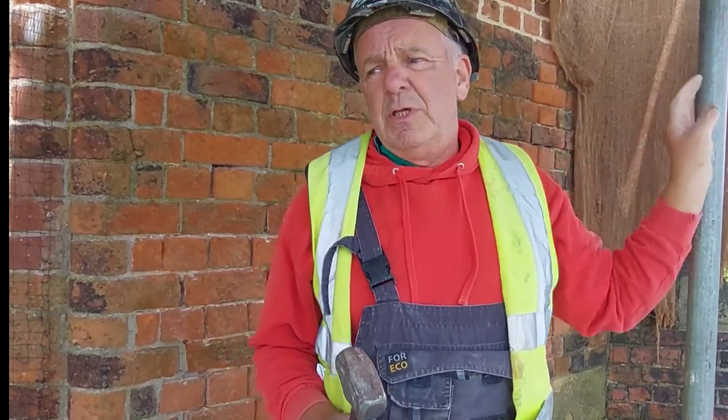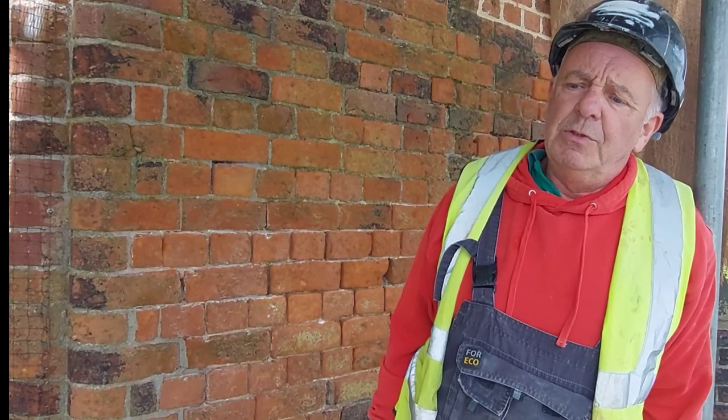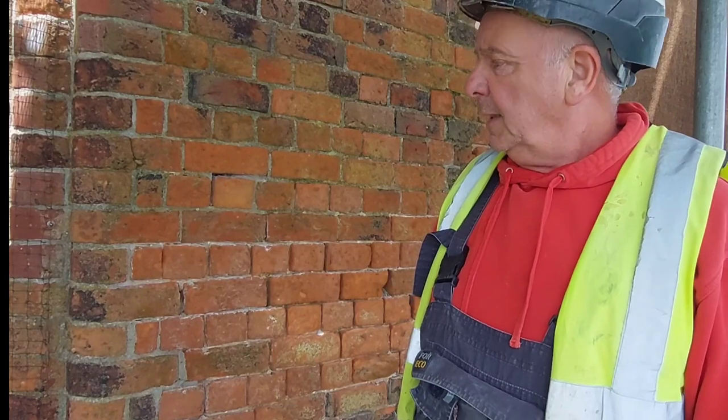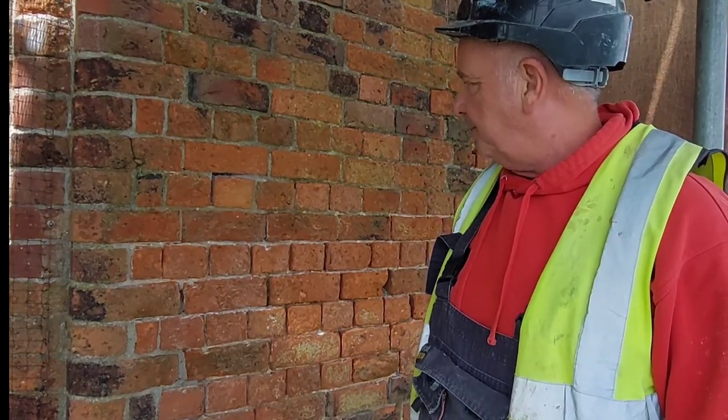And it was pretty much the same with this one. They basically wanted NHL 3.5 because that's what had been used in the past, but it was the wrong material. It shouldn't have been used. Fortunately, the diocese's architect backed me up with this, but the ones that run the day-to-day running of the church, so to speak, they got it wrong and they thought they were right. So you've got to be a bit of a consultant and teach them the wrongs and rights of how it should be done.